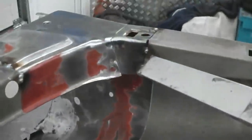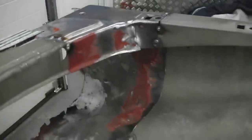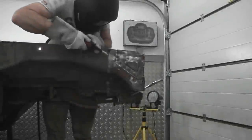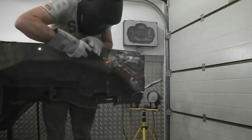Right, just using my very thin chisel, spot weld splitting chisel, to check that it runs flush. And there's many intersections. Look how many intersections you've got to get there. And we seem to have it. I've got a metal dolly behind the panel, holding it with my other hand as I get these panels to go through. So we're getting them through before we put any more tacks in. And here we are on the other side. A couple more tacks just to progress.